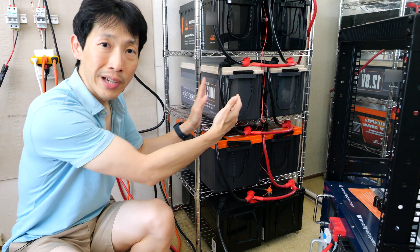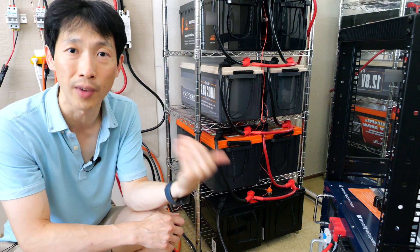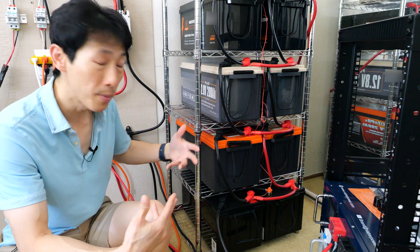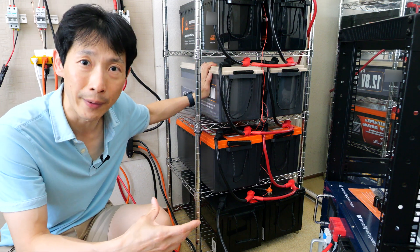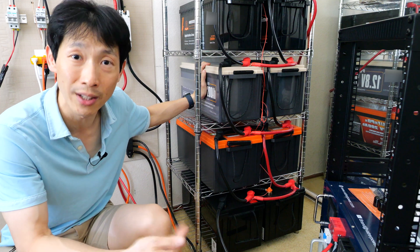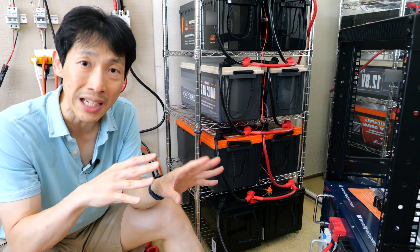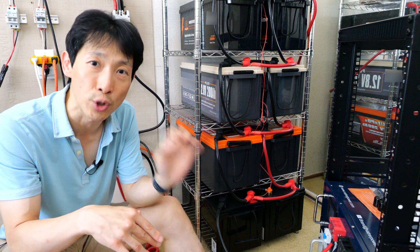But these kinds of batteries are a bit more narrow — you can shove them into different spaces. They're also a bit more granular in terms of upgradability, because you can just buy one for $500, and later on if you want to add capacity, you can buy another one, charge them up, string them in parallel, and double your capacity. If you already have two of them and don't want to discard them, possibly buy two more, string them all in series, and move to a 48 volt system. If you're building from scratch and need at least five kilowatts or more, I would definitely just buy one server rack battery instead.